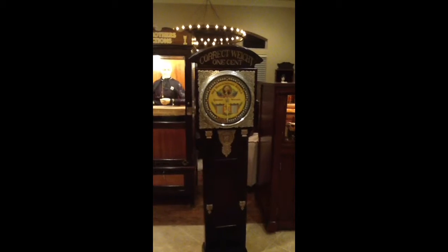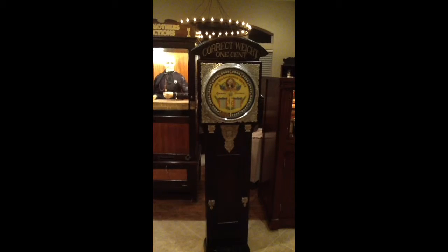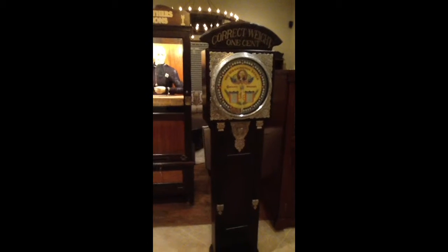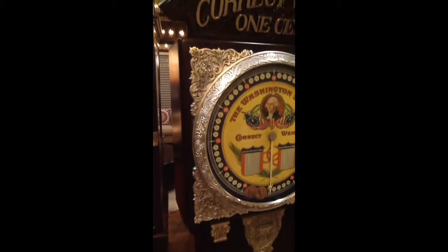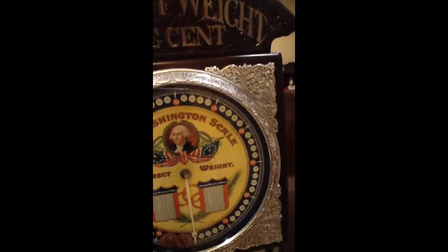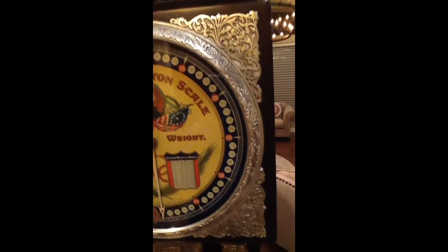This is 100% original. I went through all the internals and got everything working perfectly. Did a little adjusting on the mech. Lightly, ever so lightly, polishing all the original castings. Absolutely no reproduction castings on this. And then just touched up the wood and oiled it. And it's just beautiful. Polished but still got its patina.